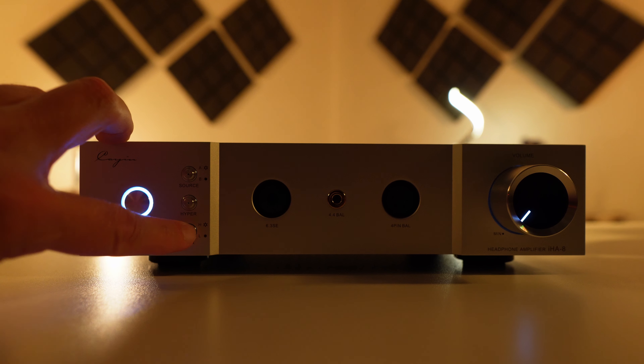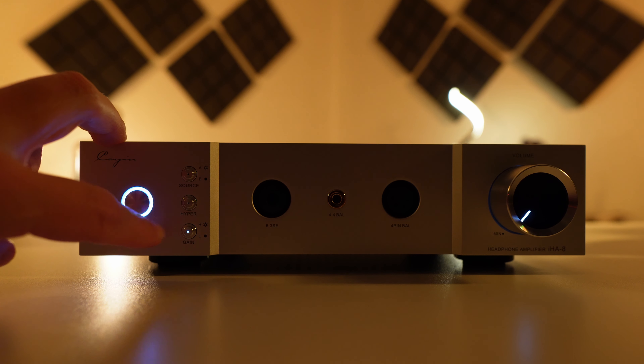The bottom button is the low and high gain. Please don't mistake this for more or less power — it is simply just a boost in volume. High gain will give you a 12 dB boost if you need it. Another note: if you are in pre-mode on the amp, the amp will always be in high gain — the full potential of the amp.